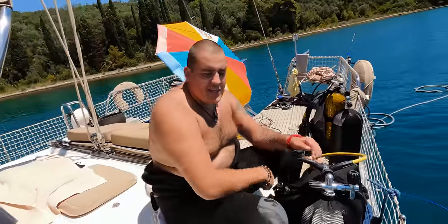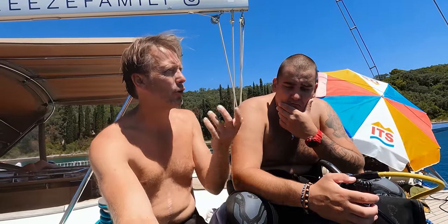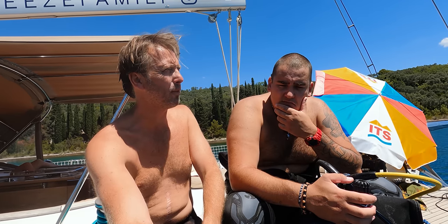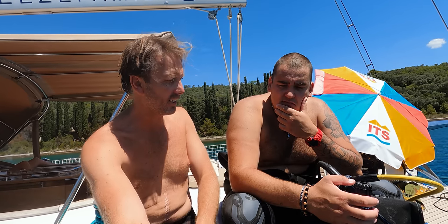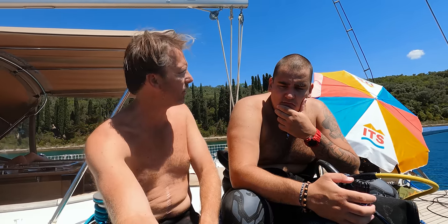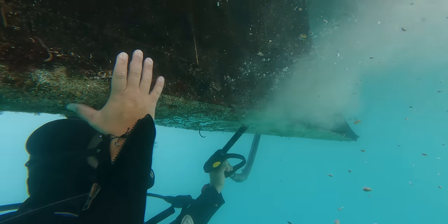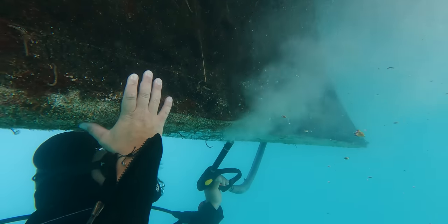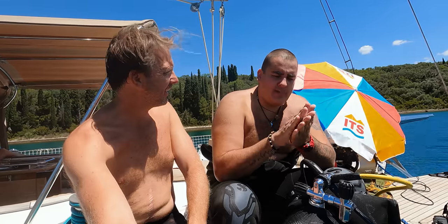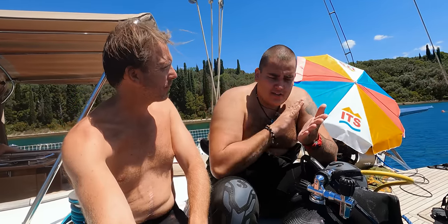This was a pause, right? Yeah. I'm very satisfied with taking all the dirt off with the spatula, but I'm very impressed by the cavitation technique because it's much easier to get it off and you are not damaging anything. Yeah, basically, like I told you, on a microscopic level, you have small bubbles of air between anything, for example between anti-fouling and dirt, between Finsulate and dirt, and those microscopic bubbles of air go inside and remove the dirt without damaging the surface.